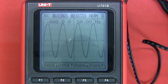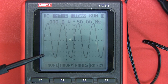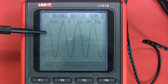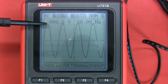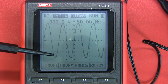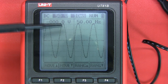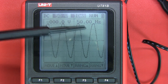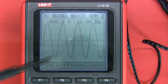We've got 50 volts per division, and the frequency is at 50 hertz. This is interesting because in theory this should be set up for US power - so let's count the divisions. The voltage RMS will be around 110-120 volts. I'll put the multimeter on this to check - it's coming out at about 114 volts AC and the frequency is indeed 50 hertz. So this transformer isn't doing anything with the frequency, it's keeping it the same as our mains supply here in South Africa. That is the initial AC mains signal coming in, and we'll have a look at it once it's rectified.